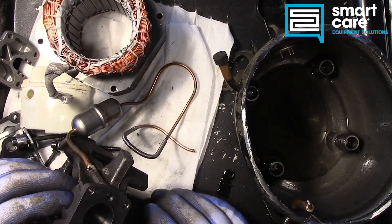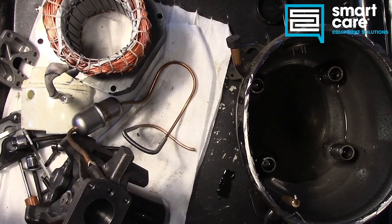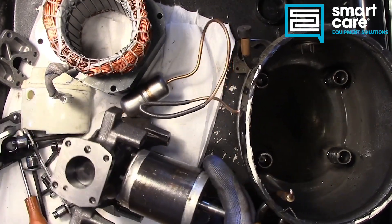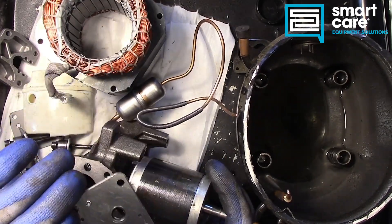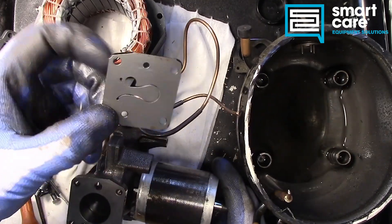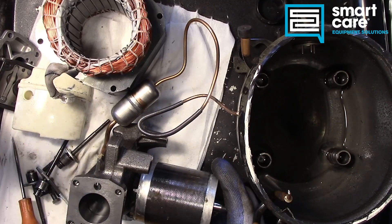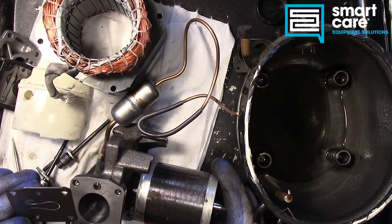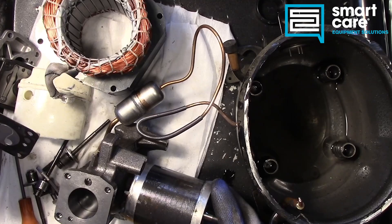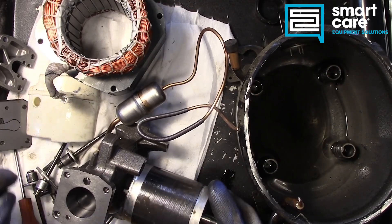As far as how this fails mechanically: the biggest one is just wearing out in terms of mechanical movements. The valving plates are made out of spring steel and they do last a long time, but they will eventually cycle enough times that they crack through. So even if this thing is perfectly maintained, never slugs liquid, and always has a pretty easy life, there's a limited number of times this can flex before it's going to crack and fail. Wearing out the valves is one way to have a compressor fail.